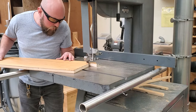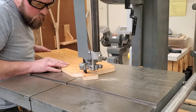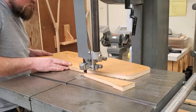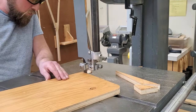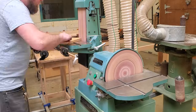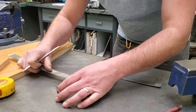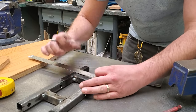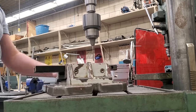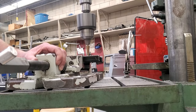If you don't have giant stationary equipment you could probably cut all of your wood out with a jigsaw — I show that in one of my other YouTube videos where I build an arcade cabinet using mostly basic woodworking tools. There are handheld equivalents or complete hand tools to make cuts like this. This looks a lot fancier now. I do end up changing the butt support — the rectangle shape was not quite working for me and ended up hitting my thighs depending on how I sat. I don't show it on camera but I do trim it — you'll see the cool shape later that ended up being really comfortable. I'll be using T-nuts, which you may have seen in my arcade videos, to hold the wood to the metal — quarter inch UNC or quarter inch coarse bolts with the matching T-nut.